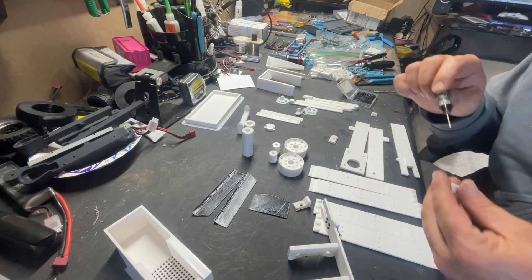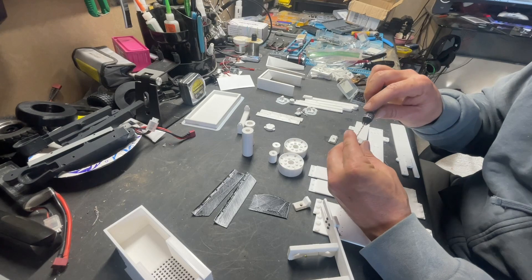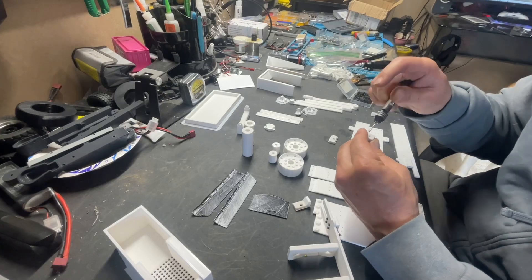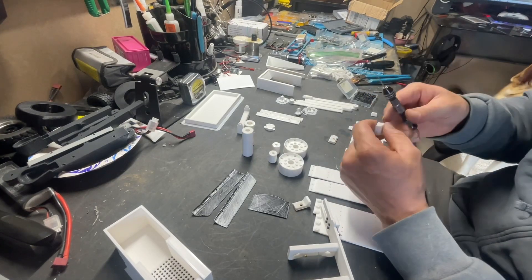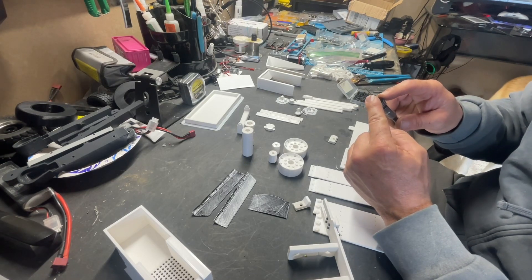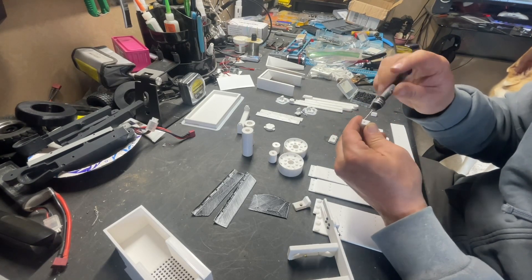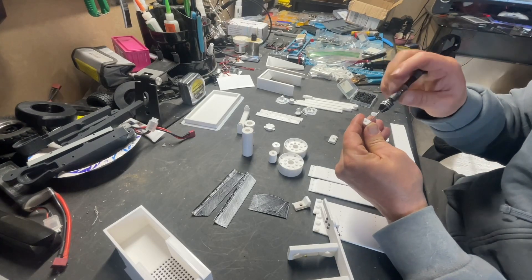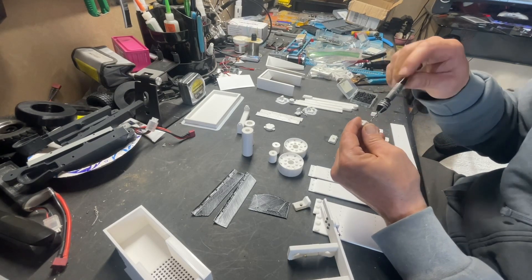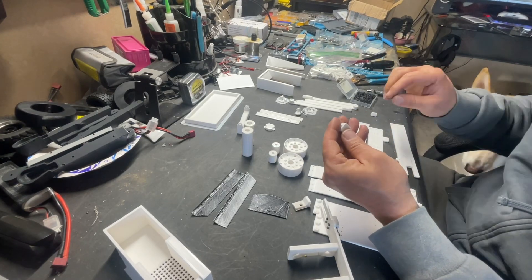PETG is a real finicky filament — it will either snap or just crack, it doesn't really flex. PLA is a little bit more forgiving until you let it sit in the sun a little bit. This is a drill bit for a 2 millimeter fine thread screw — it works really well, I think it's about 1.65 millimeters in diameter. It works really well for what we're doing here. Like I said, I drill most of my holes out, especially these smaller parts.